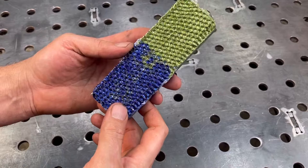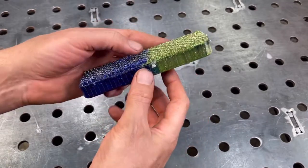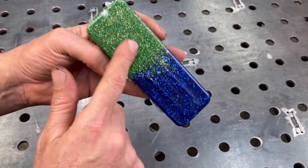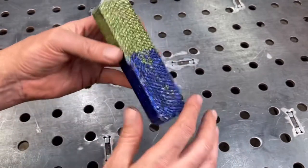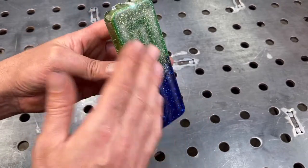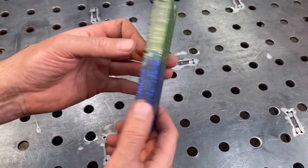Right out of the mold, you can see it's really rough on the top because the mold was only so deep — just over half an inch. The bottom has a really nice color to it, but you don't see the aluminum honeycomb. So what I have to do is sand this down, sand this side too, until I have that aluminum honeycomb exposed, and I'll do a little bit of polishing just to visualize what the pattern and the colors look like so I can use it as a knife scale.